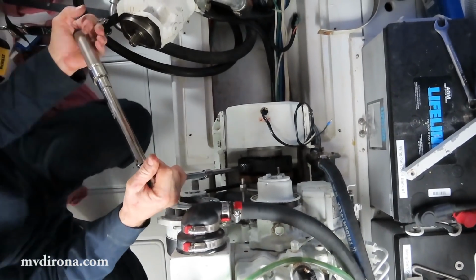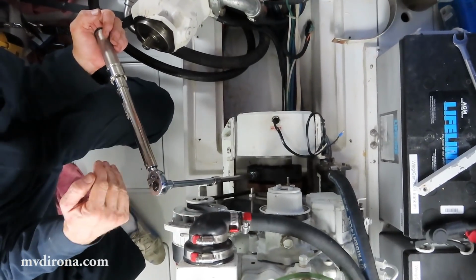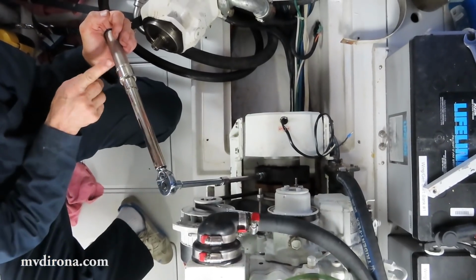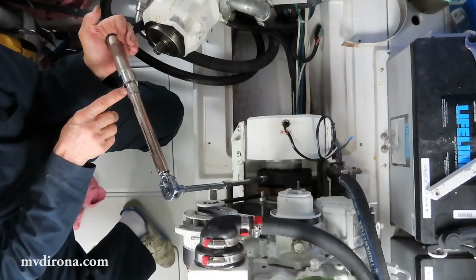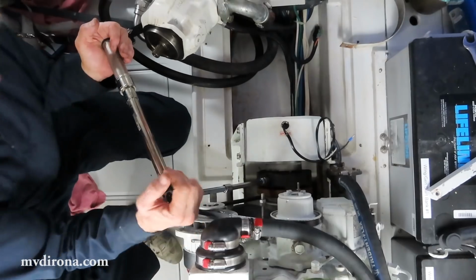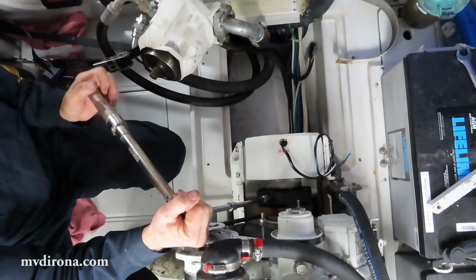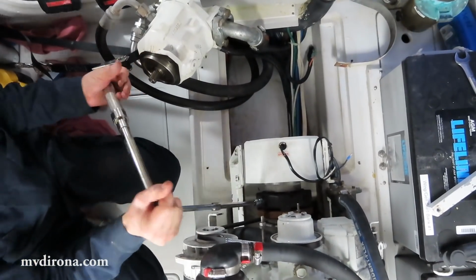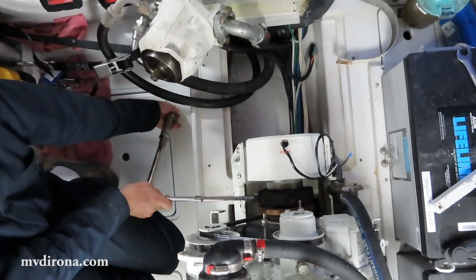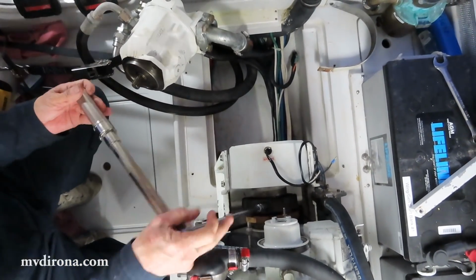And how does a torque wrench work? A torque wrench works by bending a bar inside, and then it goes over a detent and goes clunk, and it's set up with a spring against the bar such that it will signal the proper torque that's been adjusted on the spring. So that's the click you're looking for. So I normally do it 3 times, but I'm certain it's no different than once.